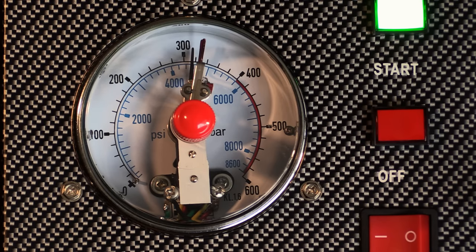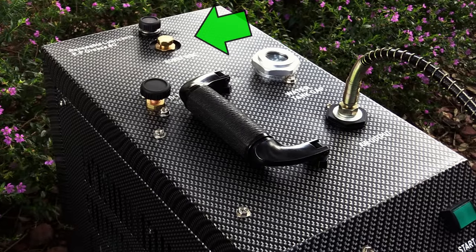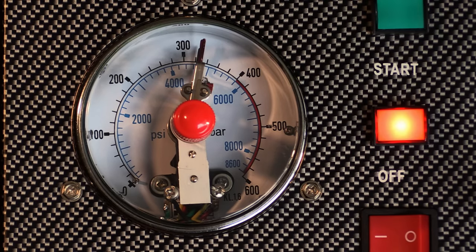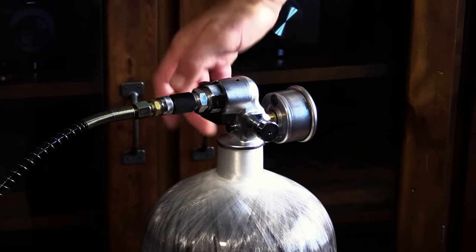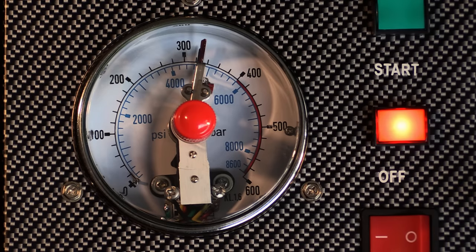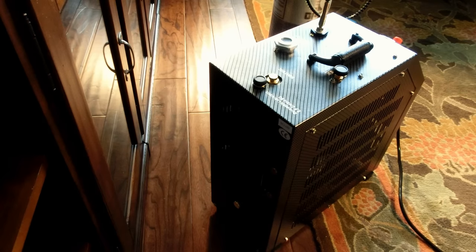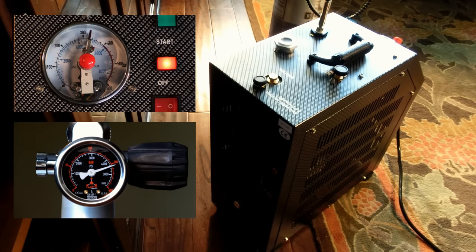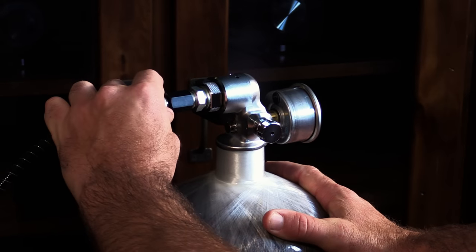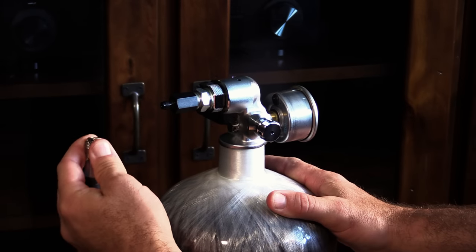If for some reason air pressure exceeds 4,800 PSI, the burst disc on the compressor will rupture. If it does, the supercharger ships with additional discs. The sound the supercharger makes reminds me a lot of a dishwasher and it's about as loud as a washing machine. Once done, close the yoke on the SCBA tank. The fan running in the background is the water pump and cooling fan — they'll continue to run until you throw the master off switch. Now open the bleed valve on top of the compressor. This purges the air within the compressor as well as the pressure in the air line between the compressor and the SCBA tank. Once purged, you can safely disconnect the air line and reinstall your fill line.